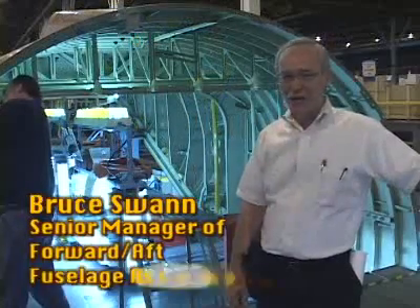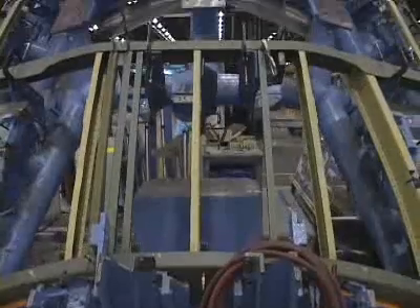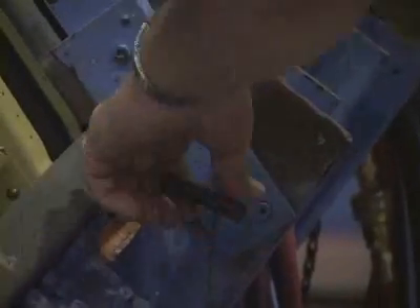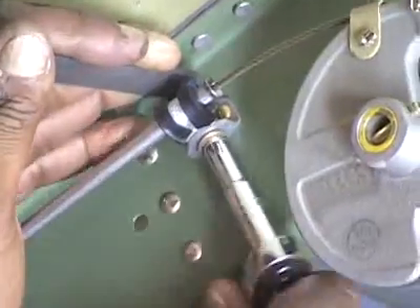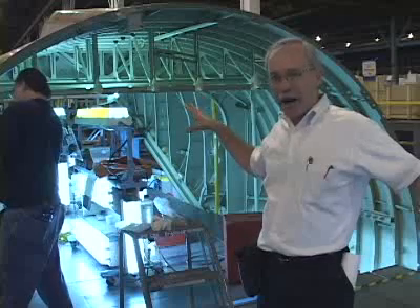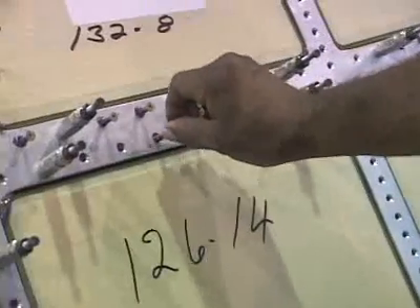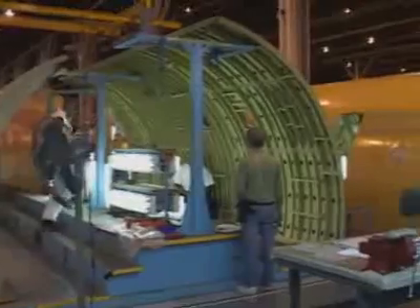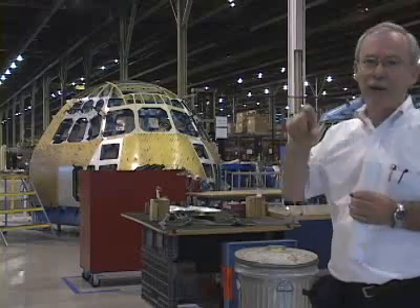We're in the aft fuselage now on the C-130, and much like the forward fuselage, the process is similar — just a different piece of the airplane. We start with the assembly tool behind this position, where we put together the top panel and the left and right-hand side panels. After we assemble that, it comes up into the pickup position, and we begin to stuff it out with wiring assemblies, bracketry, and things that we couldn't install back in the jig. It's at this point that other things like windows and stabilizers are added to the fuselage. Mechanics have 15 days to complete this part of the construction. The mid-fuselage assembly is handled by another team and takes 54 days to build — what we call stick building, putting it together one piece at a time.